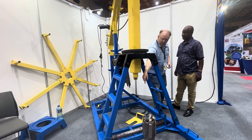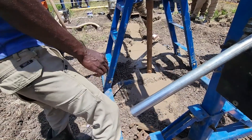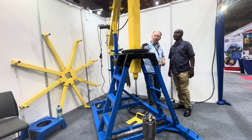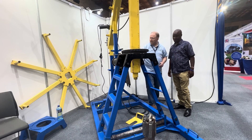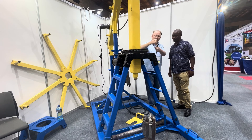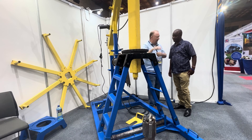You attach the drill string right here with the bit on the bottom. As you drill, it'll just lower down — you lower the winch. When the Kelly bar gets to the bottom, you stop the machine. Then you lift the Kelly bar back up, detach the rod, put a new rod on, and you go down again.